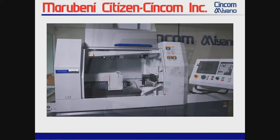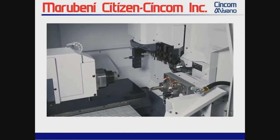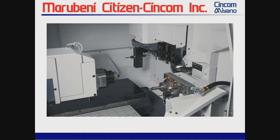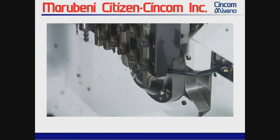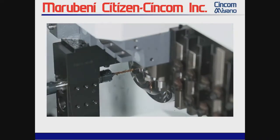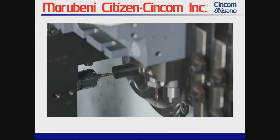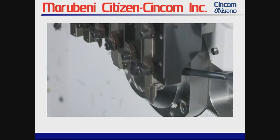As Mike told you, we're going to be demonstrating turning a part using LFV on the L32 Type 10. Notice the large workspace area, easily accessible to get to the tools. So we're going to face off. We're going to start with an ID move. Note how small the chips are coming through the drills instead of long stringy chips as you would expect. They're very small, very controlled. Also using axis superimposition so we can do 2 drills at the same time.